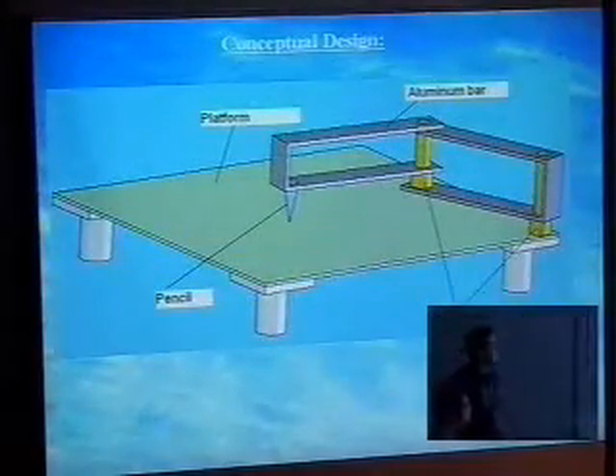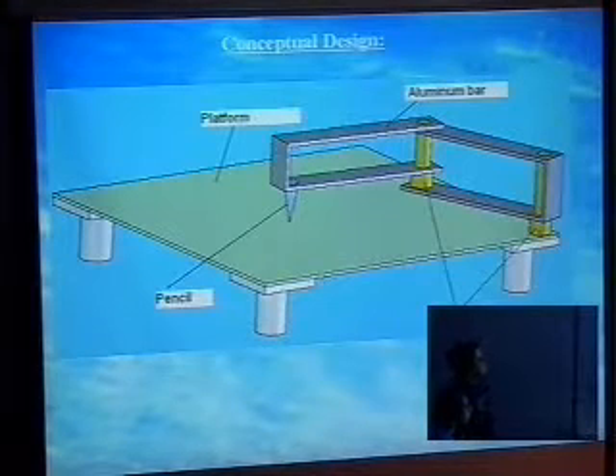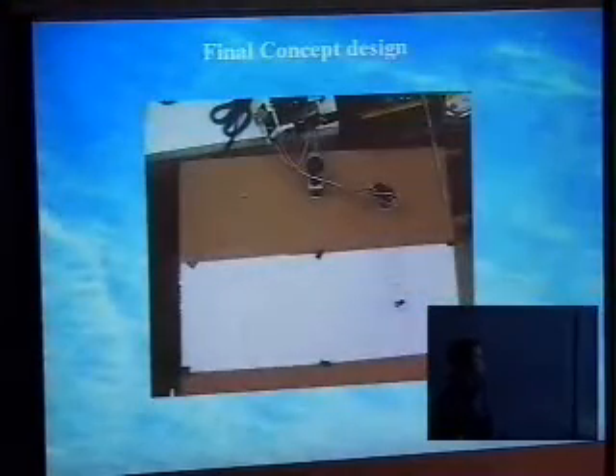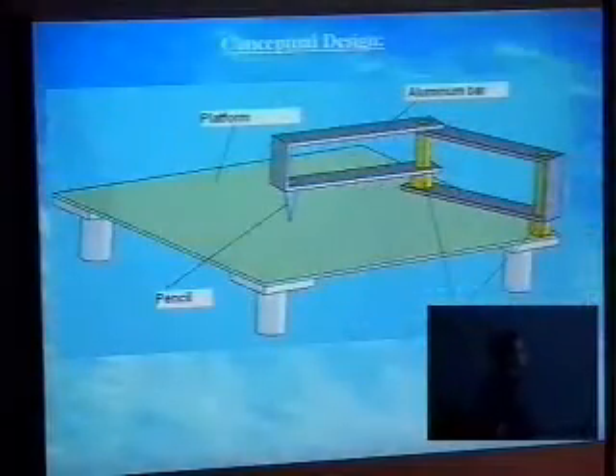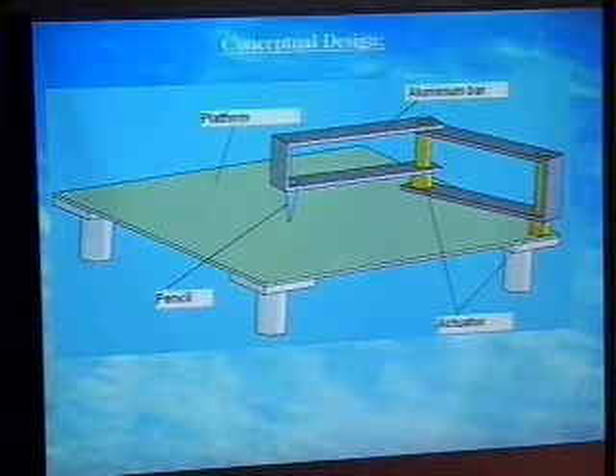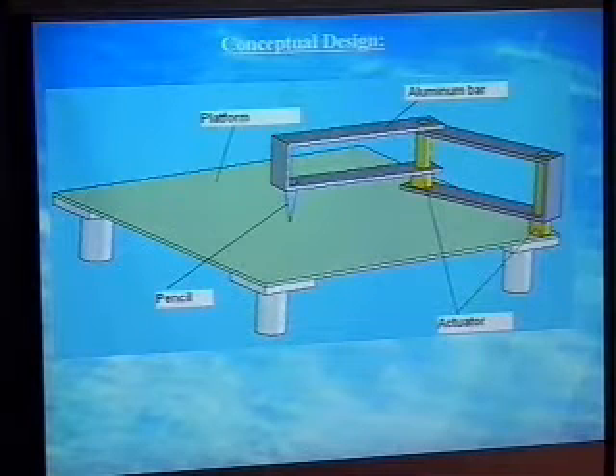This was our original concept. It was going to be made out of aluminum using bronze self-lubricating bushings. But we ran into the problem that we would have to mount all those servos away from the axis of rotation and use linkages — much like how your hand and arm work with tendons. That would introduce a lot of play into the system, and for our intention of drawing rectangles and circles, that would not have worked very well.